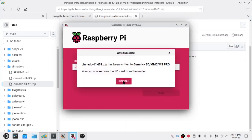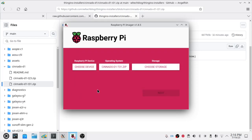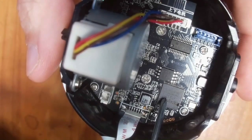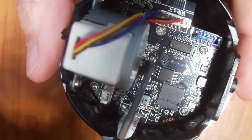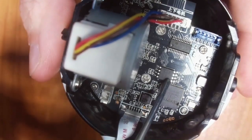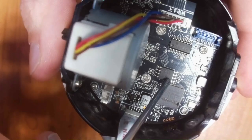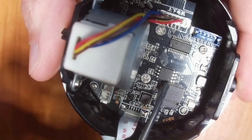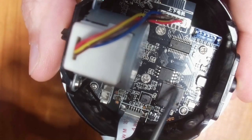Good to remove the SD card. Now I'm going to pull a couple more wires on my cam just so you'll be able to see it better for the next steps — this is just for the camera, you won't need to do this on yours. The two chips that are interesting on here: we've got our processor and then we've got our flash chip next to it. If you look at the flash chip, you'll see there's a dot right here. That dot denotes the location of pin 1 on the chip.